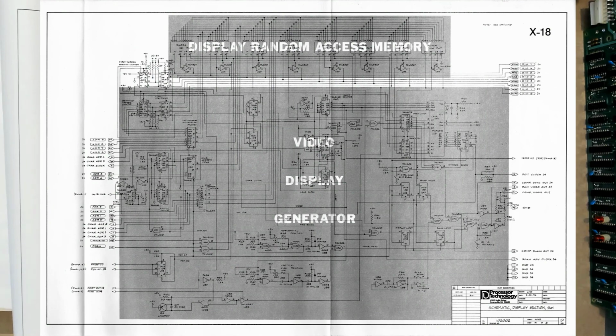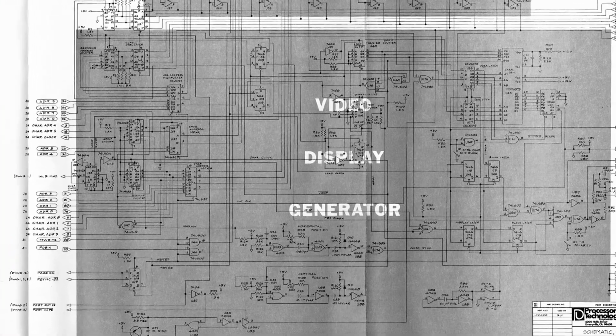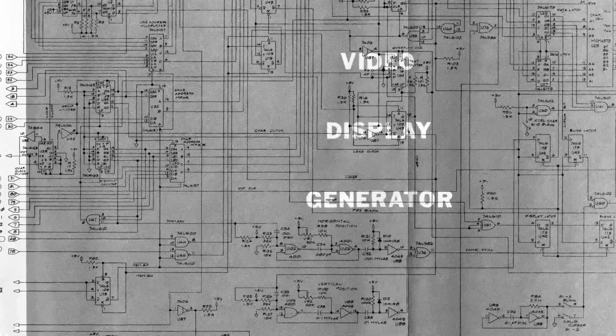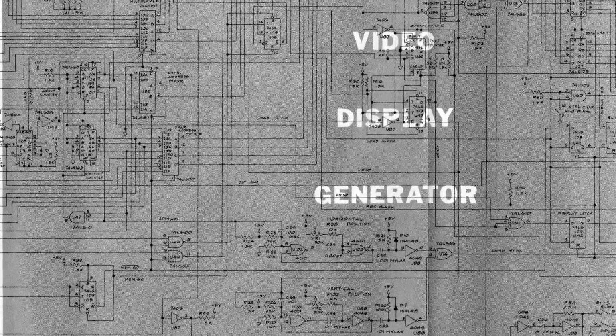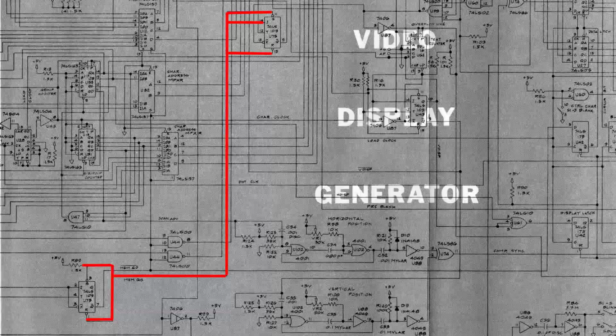Now the vast majority of these inputs that are tied together, they're frequently things like latches, set and clears, and they're tied to the same pull-up. So at first glance it looks like they're signing up to the Motorola religion of tying absolutely everything through a resistor. When they have a whole group of these that are tied together and they seem to be completely unrelated, it doesn't strictly eliminate the possibility that they're for forcing the input, but it does make it more unlikely.